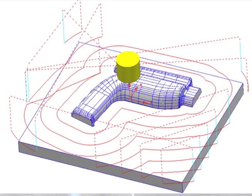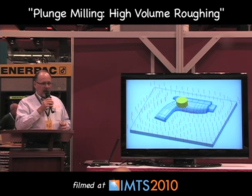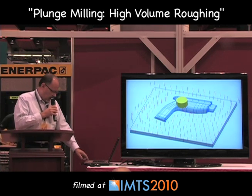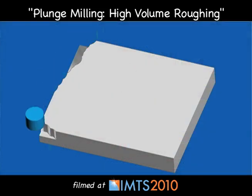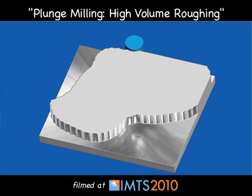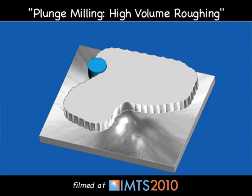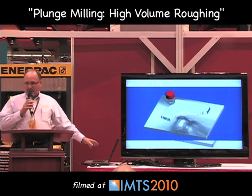Stock model utilization — getting more heavily into the programming aspects. Bill is going to go back to these slides and go more into depth. What you're going to find is a typical number of strokes going down into a workpiece, and although there are many more positioning moves, cubic inches removed is really the report card — that's how you measure if you've got a successful operation. This is, I believe, VeriCut software being done through PowerMill — an example showing from a solid state a typical way of roughing out the majority of material that's inconsequential to the actual finished product. Now you've gotten all that material out of there — now it's time to get down to business.